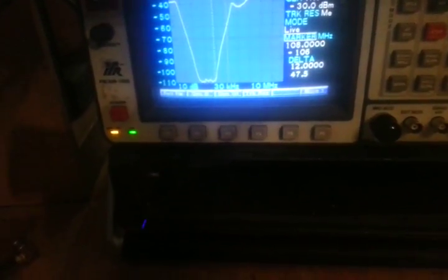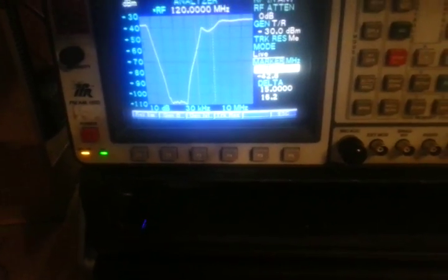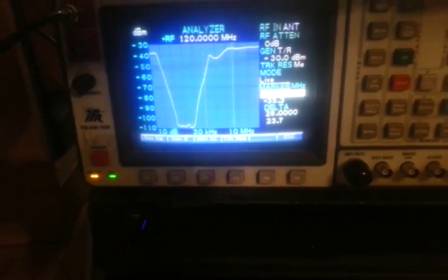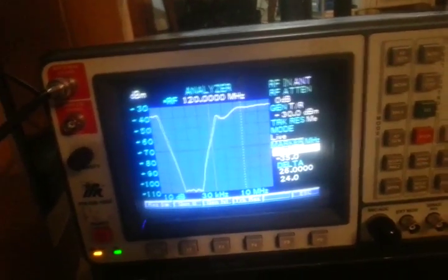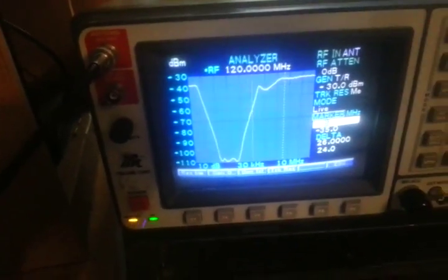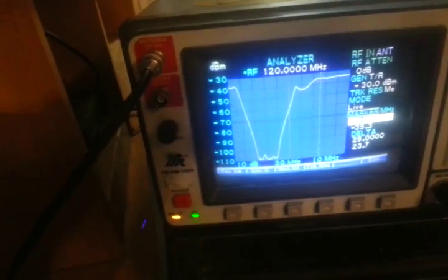The insertion loss — scrolling up to the repeater frequency — you'll see right about there: 0.3 dB loss on the receive side, which is plenty enough, because right now we're getting about 20 dB of desense from those receivers. Those are just some arbitrary numbers, but look at that curve — how much it dips down. That's amazing.